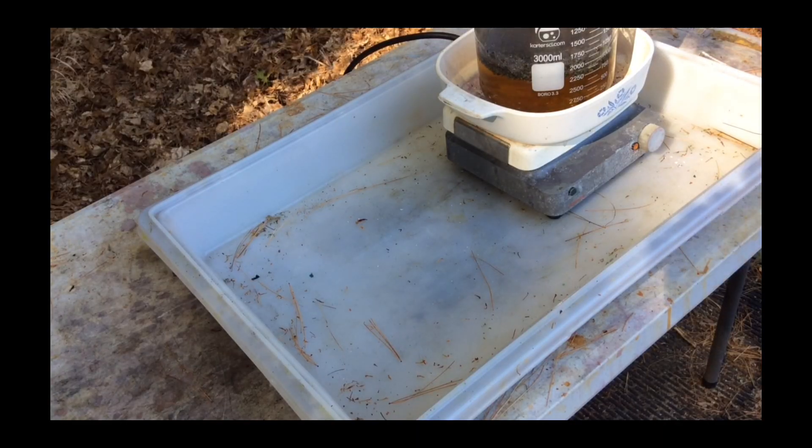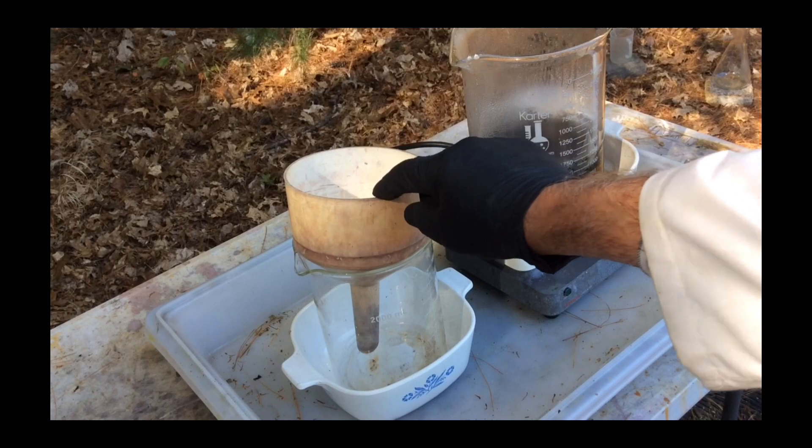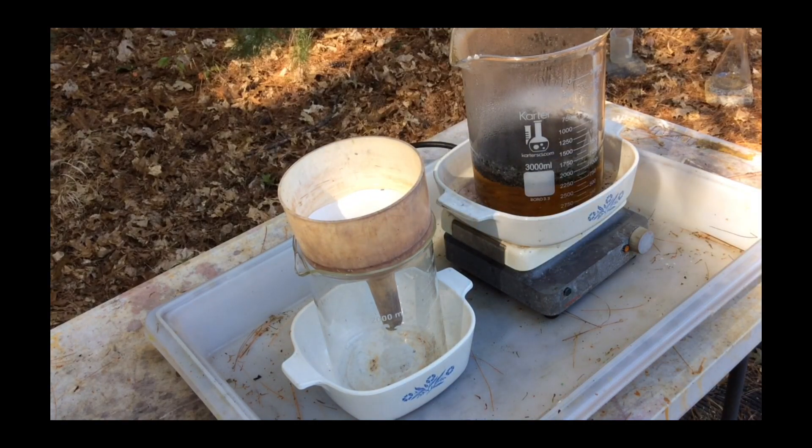So the contents of the beaker is no longer aqua regia. It is technically chloro auric acid, and I will use that phrase to refer to this liquid from here on in. The chloro auric acid has been allowed to cool and now I will start the painful process of filtering the chloro auric acid to a high purity. There is a lot of solder mask bits on the surface and probably some impurities in the liquid. Well, the good news is there are no fumes — there might be a few vapors, but the fumes are gone. So we are going to start the process of filtering. This could take a while. Always wet your filters.